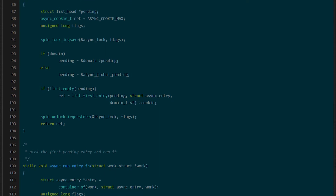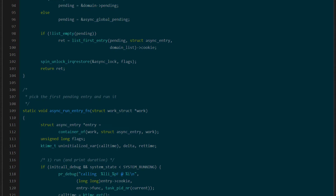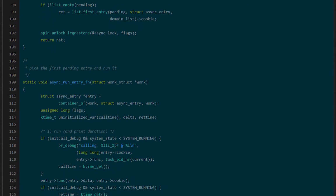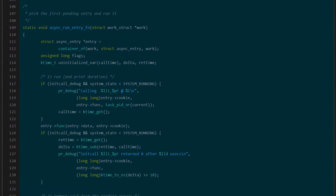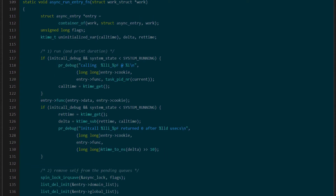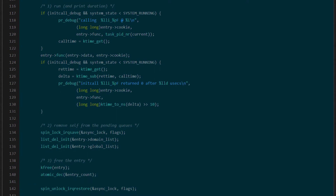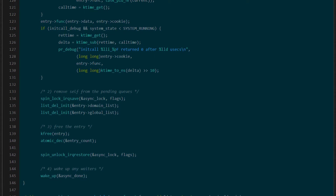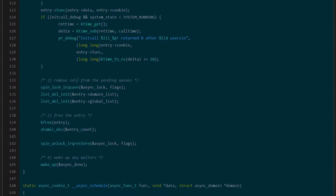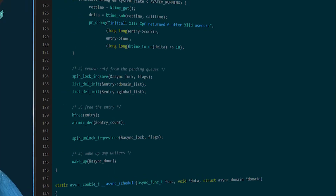In a sign of MicroPython's immaturity, the entire instruction section on this process is a total of 2 paragraphs that doesn't actually tell you how to load files. It directs you to using WebREPL, which isn't enabled by default, and I personally find extremely annoying to use. So this week, I'm going to show you how to load files onto the Wemos D1 Mini using a tool called Ampy. This tool was originally written by Adafruit, and I hacked it slightly to work with the D1.